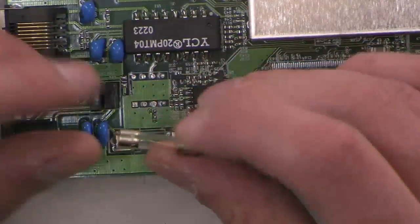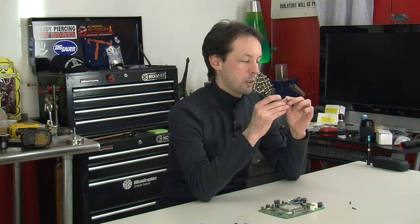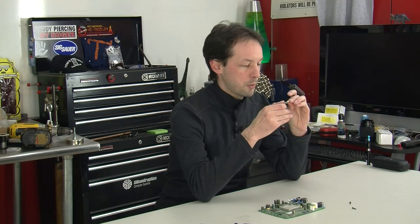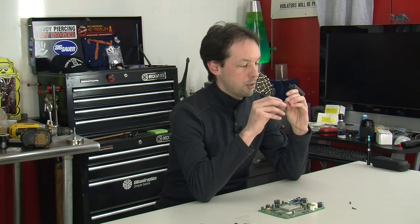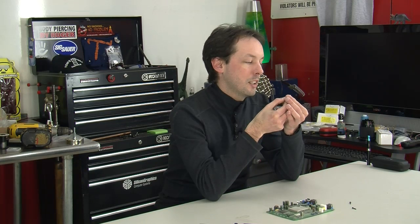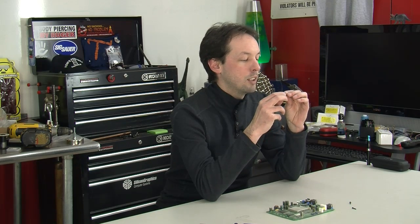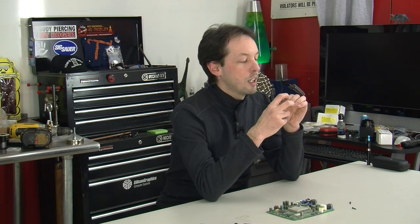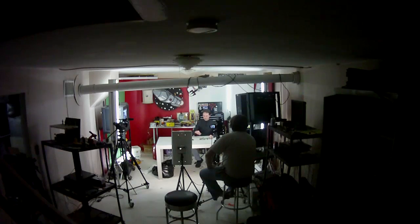We're hacking that off. There's an actual replaceable bus-type fuse. It's rated 250 volts but it won't tell me the amperage - it's an actual Bus brand fuse. It doesn't have the amperage rating anywhere on it, which is weird. What kind of fuse doesn't have its operating specs on it? There's a heart and a circle and a backwards R and a V, but no amperage rating anywhere. Let me check the other end - T1A, so it's a one amp fuse.